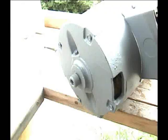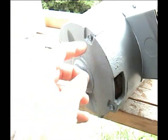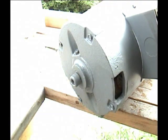That's about all you have to do for the electrical wiring. The next step is you want to take this end plate off. There are four bolts to remove, and this will pop right out. We want to cut the fins off the cooling fan because the air resistance uses up quite a bit of power. This motor will run cool and won't get hot, so there's no use for the cooling fan — it just wastes power.